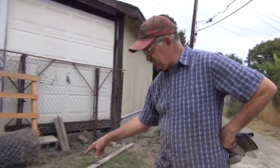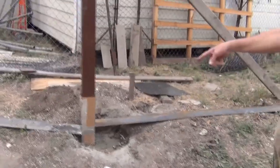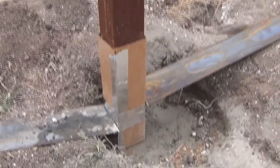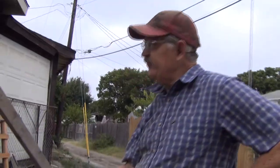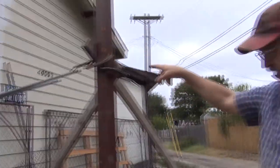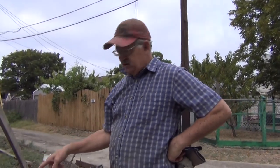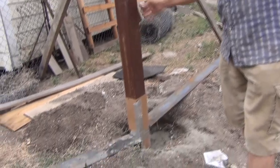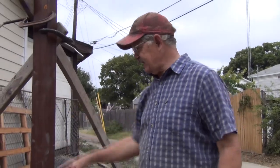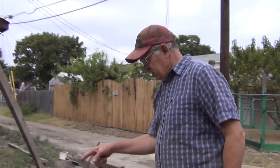I've put this post in and wrapped it with cardboard. You'll probably wonder why I wrapped it with cardboard. Well, I have two big storage and workshop buildings here that I built some time ago, and I designed them so I could always move them and take them out if I wanted to. So this post, by wrapping it with cardboard, should be able to slide out of the concrete if I ever decide to move these buildings. So I have access here and I can take these buildings out without tearing my fence all the way down.